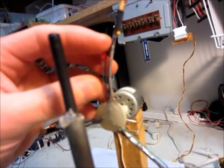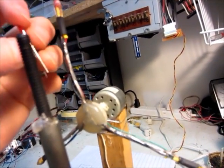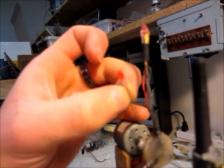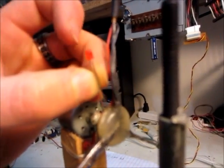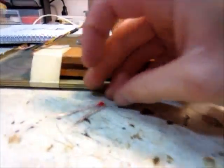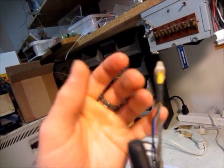Mine is about twice as big as most of the other ones out there, so there's going to be a lot more force on the LEDs. If it was only as small as the LED length, it would probably be fine without wrapping wire around it - the LED leads could probably withstand the force. But after the wire is put over top of the LED, I have put lots of super glue all over it, so that holds it on even more, because the wire has a tendency to break.